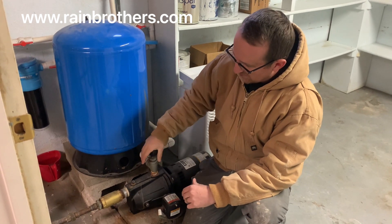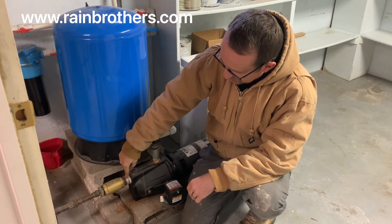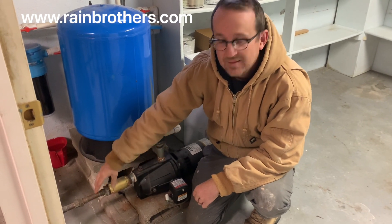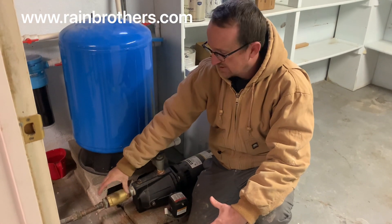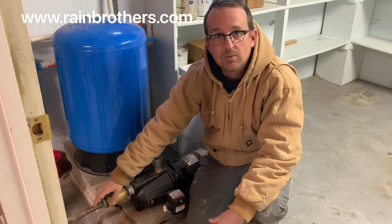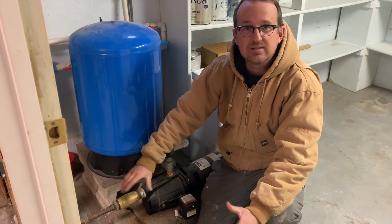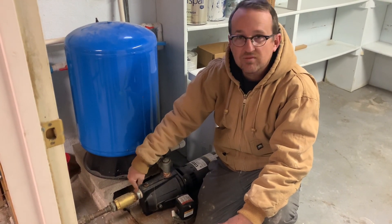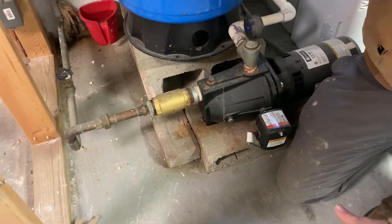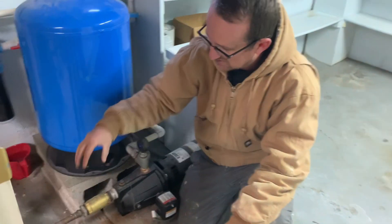This is not a good setup. Another reason it doesn't work well: we have a cast iron pump touching a galvanized nipple, touching a brass check valve, touching a galvanized nipple, touching copper. You do not want magnetic metals such as galvanized touching non-magnetic metals such as brass or copper. You can already see evidence of corrosion there, and this could eventually break. With this installation relying on a siphon, if this plumbing breaks, that whole tank will siphon out onto the basement floor.